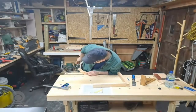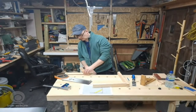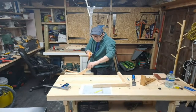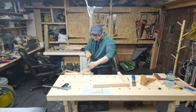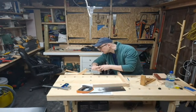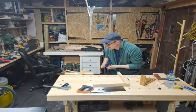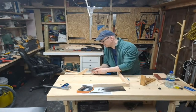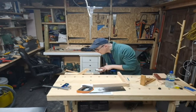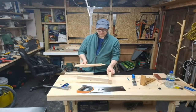So I'm going to try and avoid damaging the shoulders I've put in there. Tighten that up. Sturdy. And pop that in there. Out you come. Got our chisel. Get that in there. So far, 1 to 4 hours to prepare this. Had a few techie issues, but it's all by hand. And I think it's going all right. There haven't been major errors yet that we have to redo the timber.